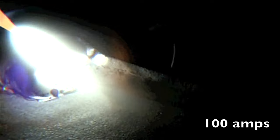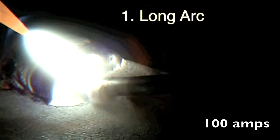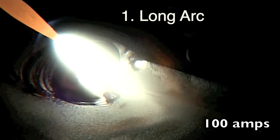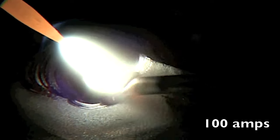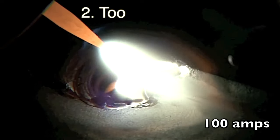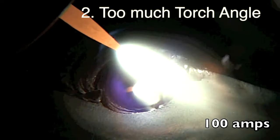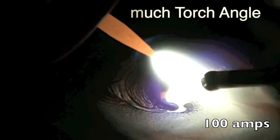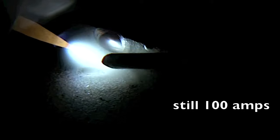I've shown this several times in other videos, but it bears repeating. Here's what happens when you do the three things wrong: too much arc length, too much torch angle, and not keeping the hot tip of that filler rod shielded. Right now the filler metal is balling up before it gets into the puddle. That's because the arc plume is too big — I can't stick the filler rod in there quickly enough before it just wads up and balls in the puddle.